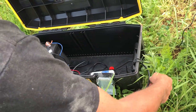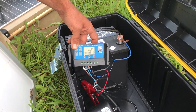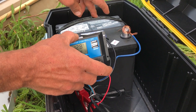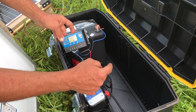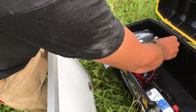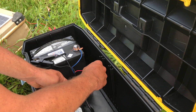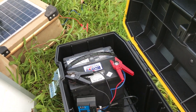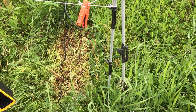The way this is set up: I drilled a hole in the side and the solar panel wire goes right through and connects to this charge controller. Our batteries are almost full — it's morning so we went all night without solar and it's down to about 80%. The charge controller protects the battery from getting overcharged. If you just plug the solar panel directly in after several sunny days you may burn out your batteries. So the solar panel goes into the charge controller, which is plugged into the batteries. Then the energizer has leads that connect to the batteries — now the energizer is cranking, you can hear it clicking — and the energizer leads go out to our grounding rod system and to the fence. Now our fence is energized.